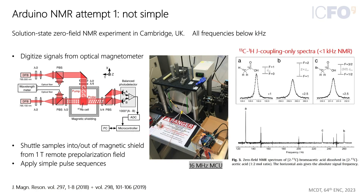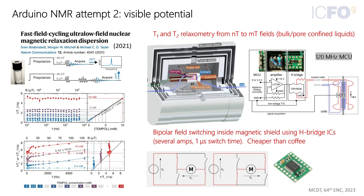They were guilty of this themselves when they started using Arduino to detect NMR signals from an ultra low field experiment. The standard Arduino board was connected up to an atomic magnetometer — a way of detecting magnetization at very low fields and frequencies. They were also using the Arduino to move a sample in and out of a magnetic shield, because it was pre-polarized outside, and to apply pulse sequences. They got some very nice zero field and ultra low field spectra, but this was not super simple to set up.